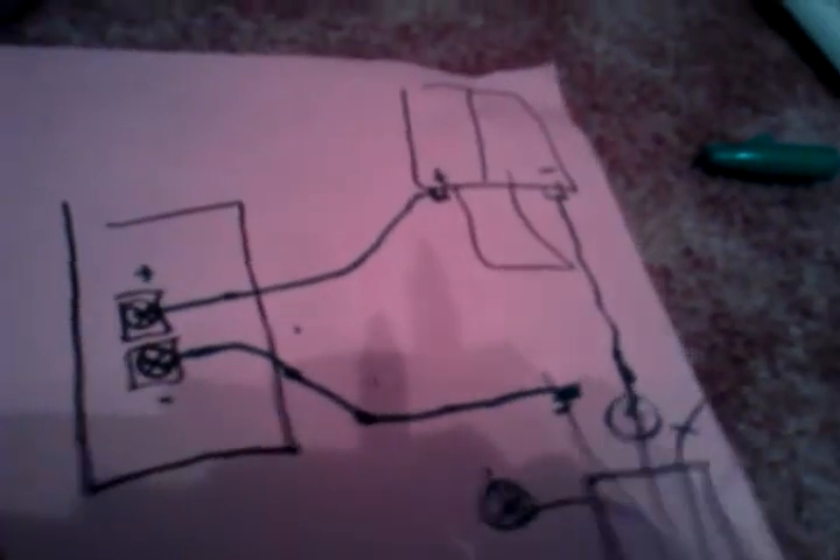You're going to wire your negative wire and bring it down to the negative wire on the pull station — it could also be screw terminals too. You're going to take your positive wire — pretend that this is the big battery pack. You've got the ends of the batteries: this is the positive and that's the negative. You would take the positive wire of the horn strobe and bring it to the positive wire of the battery, like in that circuit. And you take the positive wire of the pull station and bring it to the negative wire of the alarm. When you pull this, it creates a circuit to this, and the alarm goes off.